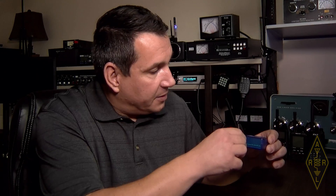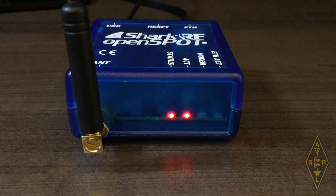The box physically has a description of all its interfaces on top of it, so it's pretty straightforward and easy to understand. On the front you have the antenna connector, which is SMA female on the OpenSpot — so it requires an SMA male antenna. You have four LEDs on the front that give you the status. There are a dozen things they can indicate, but it's pretty straightforward; you can just look at it and know if you're connected or not and if you have an internet connection.